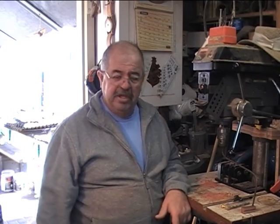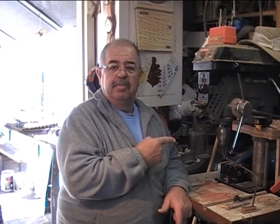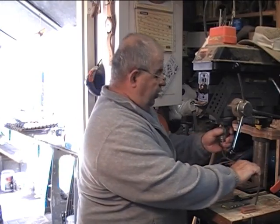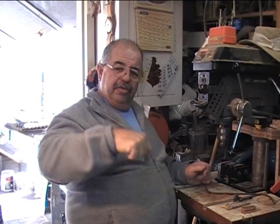Now that's going to tell me that this spindle is squared to this bed. Think about the math on it for a minute — it's pretty simple. That man was a genius before his time. This simple tool will help you align that bed. I fine-tune my bed with a rubber hammer because I hate messing with that bolt underneath and that pin that Sears put in it claiming it keeps it square — it ain't square. Okay, so now I know it's running true, and when I drill my freedom pen blanks I know it's going to go right down through the center.